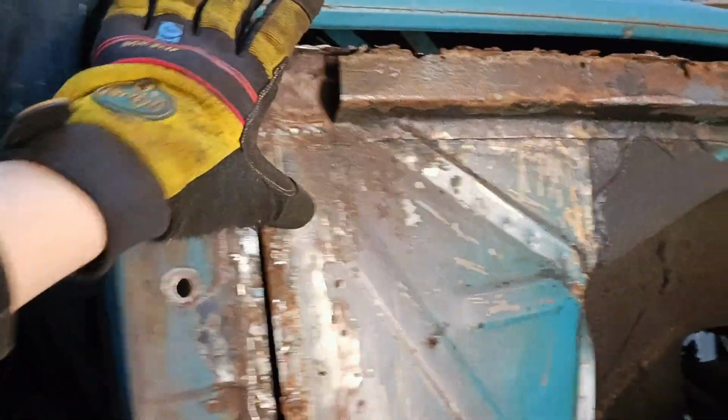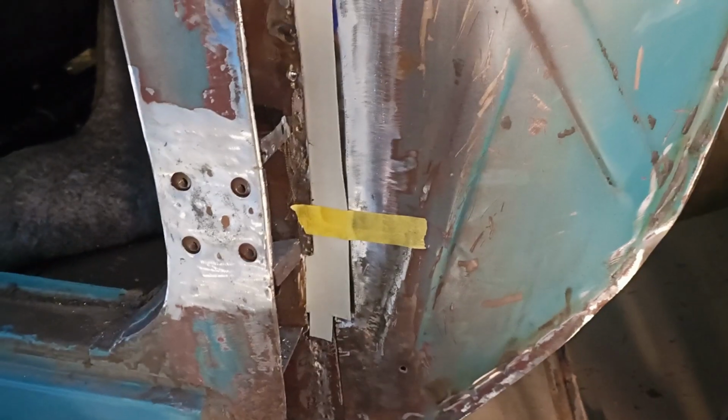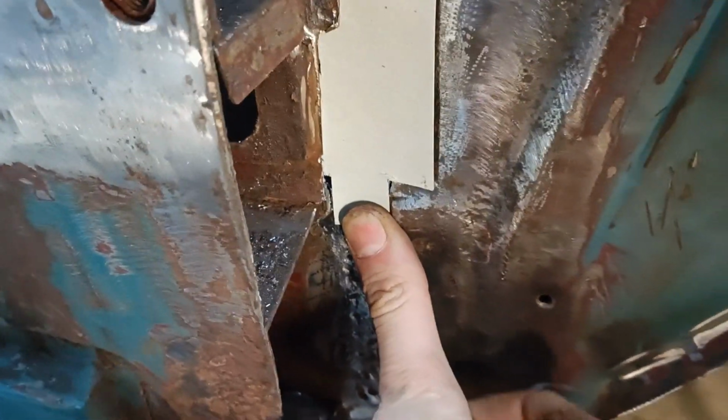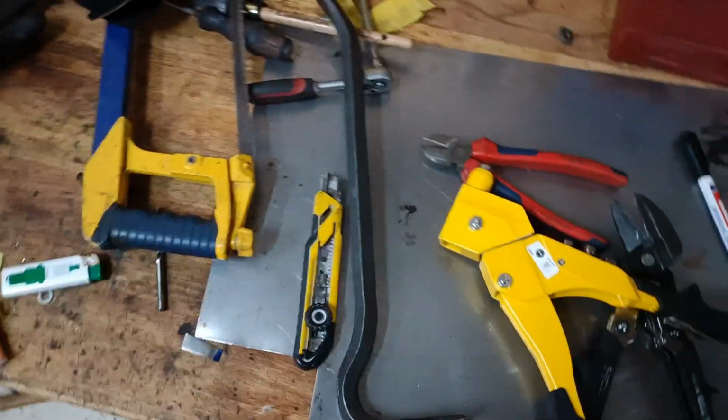And this rotten out beam, we have it laying over there. Those are the new panels. So we can cut this one out from here, up to here, and then to the front, and completely fabricate a new panel for there, which is already cut out over there, as you can see on the storage bin Volvo 240. The piece I'm making right now, as you can see, is the cardboard piece. I am still doubting if I'm gonna make this thingy over here, but I think it's the smart way to do, to get a sealing weld and stop water from coming in. So the thing I'm gonna do now, of course, it's stuck inside of the car right now. So I need to find myself a writing device, or a pen, how you would call them.